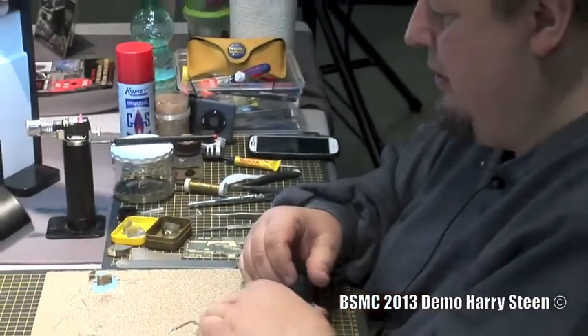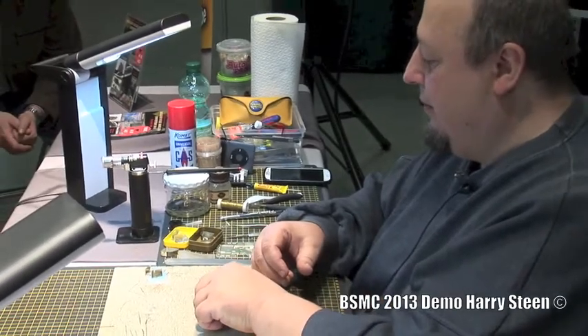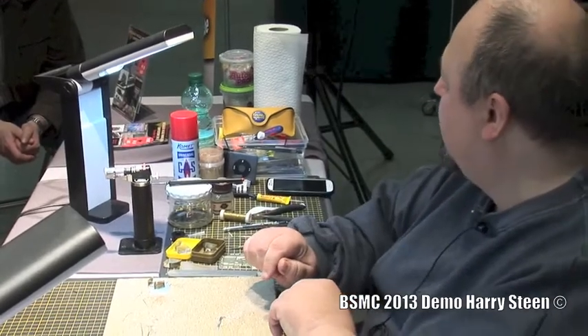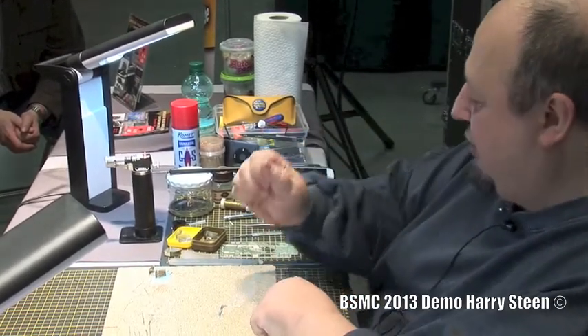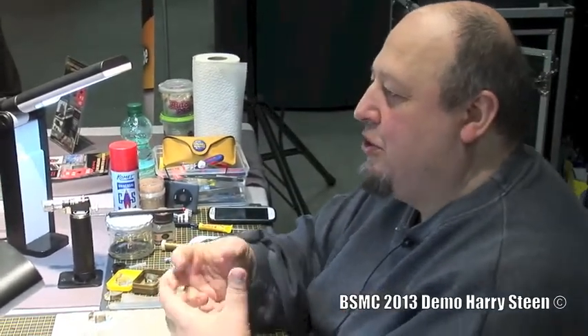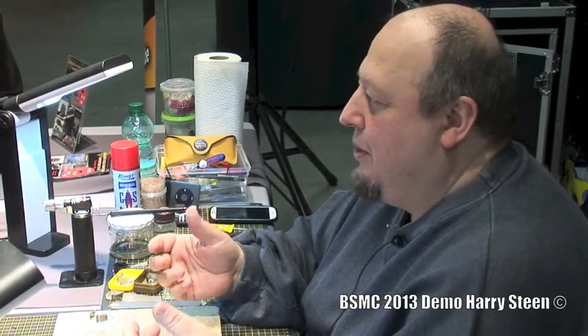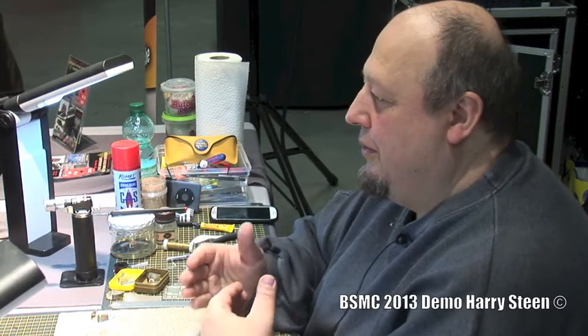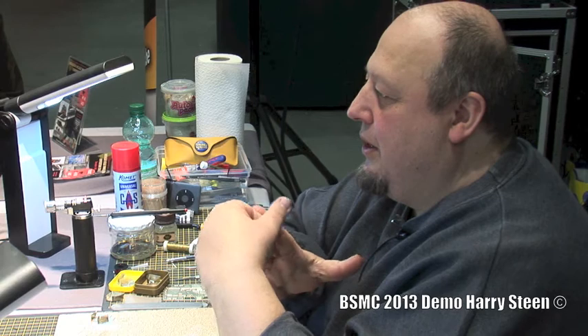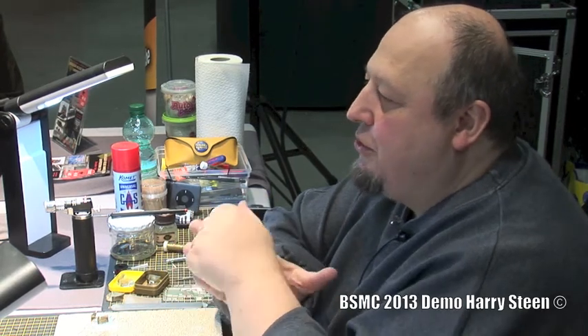There are also bad soldering connections. You see that I'm doing something that maybe people tend to do differently. If you use a soldering iron, sometimes people think they just have to dip the soldering iron into the solder, and then the solder melts, which is fine. But the problem is the connection is only good if the material is hot enough to do the attachment. Otherwise you get what is called a cold solder. The solder is hot enough to melt but it's not attaching to the metal. In the best case you get a connection as if you used super glue — a slight turn and it's off again.